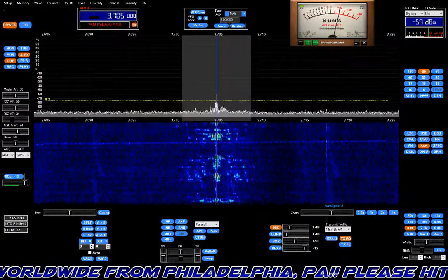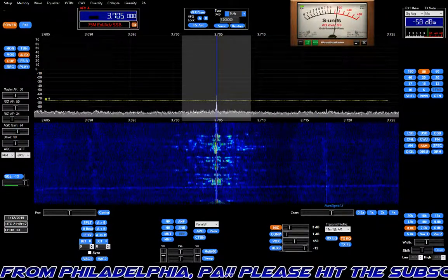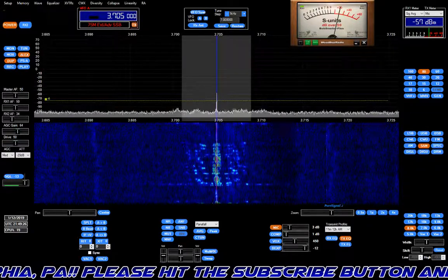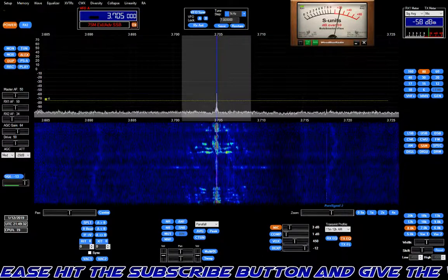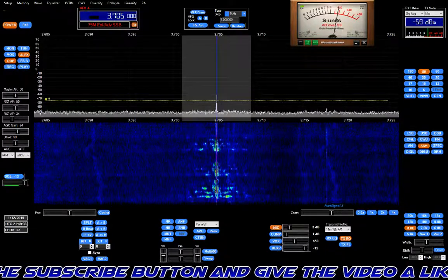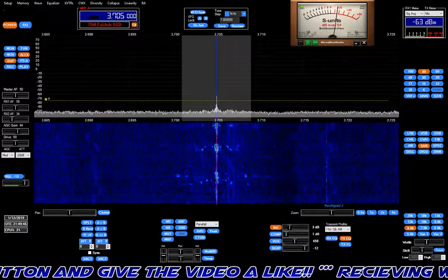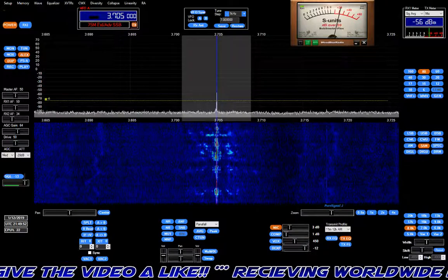So I have to roll back the plate supply because it's a common plate supply between the grids, plates of the 813s and the plates of the 833s. The power supply is variable from nothing all the way up to nearly 4,000 volts. I think about 3,600. And it's this big 240 volt variac on the primary of the power transformer.